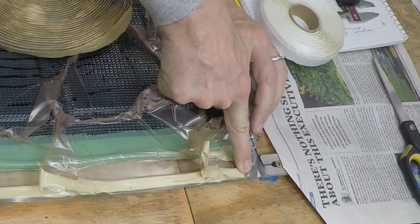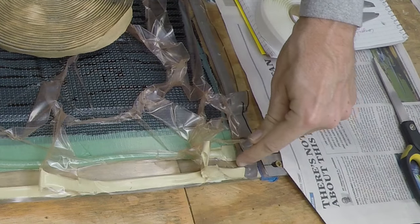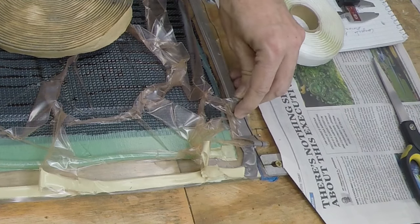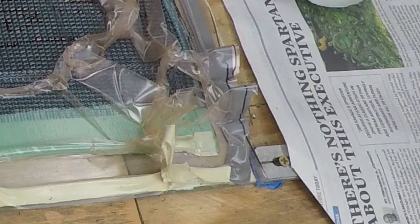I also encountered another issue: frequently you have to make overlaps of your tacky tape as you're putting it down, and you push your finger into it to seal underneath where you have a small crease. I noticed that the Home Depot butyl tape does not squish as easily as the traditional tacky tape, so I had to push harder to make sure I had a seal wherever two pieces joined. As far as pleating goes, the Home Depot butyl tape worked just as easily as the traditional tape — I was very pleased. And I was really surprised that when I pulled the vacuum, I had absolutely no leaks at all. All the seams and creases sealed beautifully.